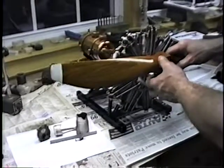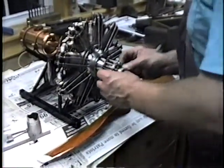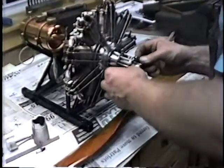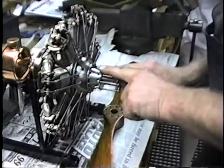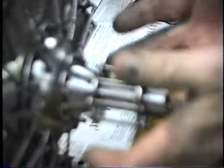This is the propeller. This is a washer — this is supposed to come off and this goes on. All these bolts go through this, and that's how it's held on. It's a drive washer — the washer is splined to the shaft here, so it becomes a drive washer just like the back one. So it drives through these bolts. The entire torque of the engine is putting power through here.